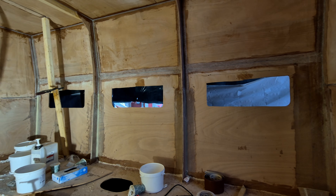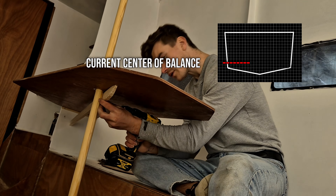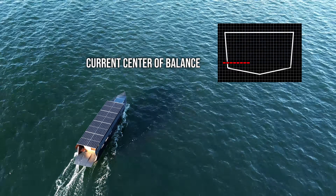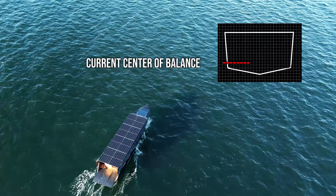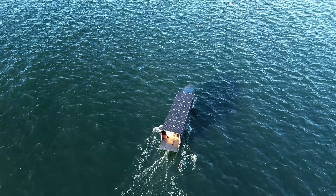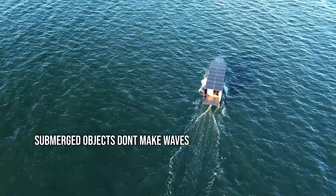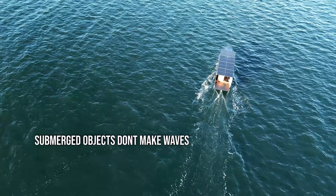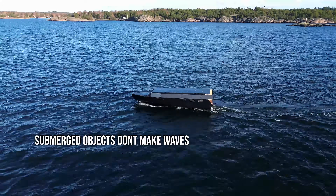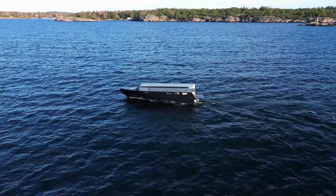The boat is light, efficient, and self-righting according to geometry and center of mass — so I thought I would simply ride through the conditions. That is partially true, but not comfortable and not optimal. Most resistance, slamming, and discomfort actually happens only near the surface layer. A hull that skips over waves or rolls excessively is often less efficient than one that sits deep in more stable water.